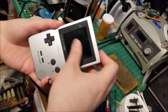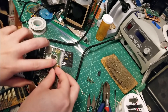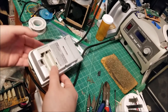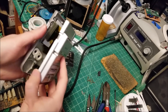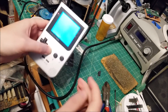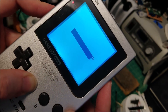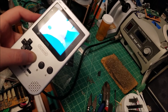Just taking a look — it should look pretty much pitch black now when the screen is off. Running another quick test before screwing everything back together. When modding Game Boy Pockets especially, you want to check often after doing a little bit of modification. There you go — you can see just how much darker the screen is now. The contrast is a lot higher; it's a bit more purpley on camera, but in real life it looks pretty black. That looks pretty good — this is pretty much done.